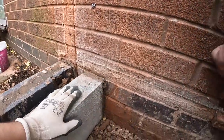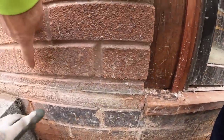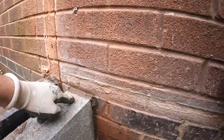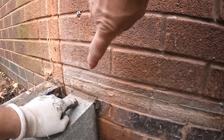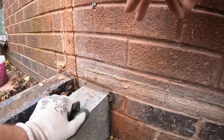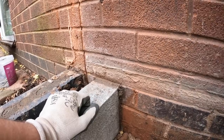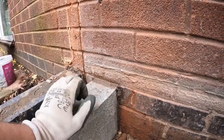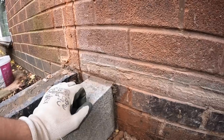That's the door threshold level. So we transfer that across to there, and we measure back down. It was 83 mil to the floor inside, so it's 83 or 84, maybe 85 to the block. We're better slightly low, and then if you're a bit lower, a bit of self-level can bring it all right. You don't want to be high, otherwise you're self-leveling the whole room in there.